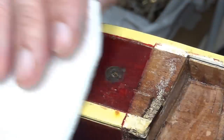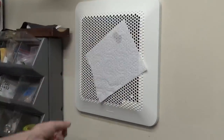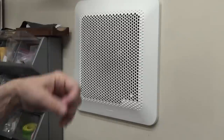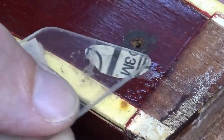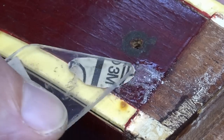Then I'll put a top coat of lacquer on there. I like to point it out, but I have a well-ventilated area here with an exhaust fan pulling that fill-and-finish nastiness out into the attic. If you're in an enclosed room with no windows, maybe move outside when using that stuff. I ended up doing about five thin coats of fill-and-finish thin. I decided that as lacquer shrinks down, it might just be too much of a hole to fill with lacquer alone, so I'll give myself a head start with that fill-and-finish. Now I'm sanding it with 220 grit sandpaper.